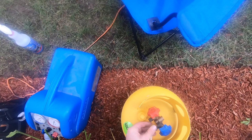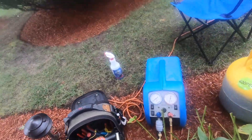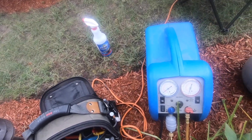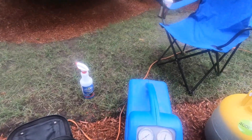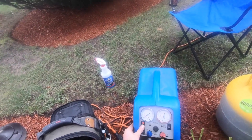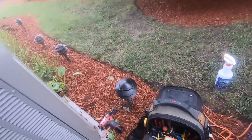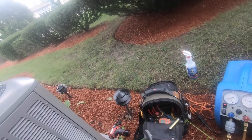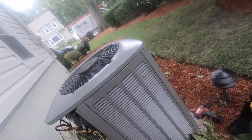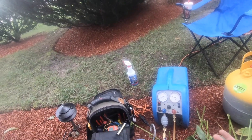Last time I used this cylinder, I was pulling liquid refrigerant out of a unit. Now we're going to open that — both of these are closed right now. Now we're going to plug in our pump. Make sure your connectors are good before everything's straight. The pump is getting plugged in. Now we're going to power the unit, start it, open it up, and recover. Now we're pulling the gas out of our unit, through the pump, and into the cylinder. This is how to recover refrigerant from an AC system.